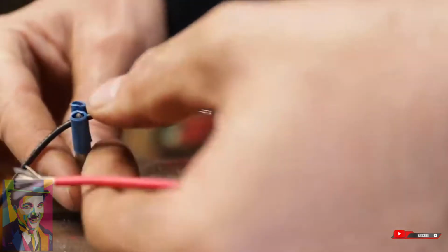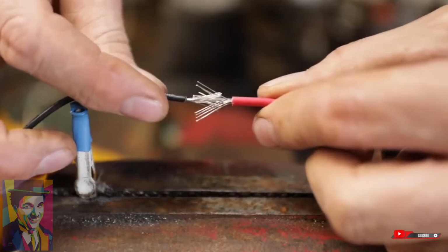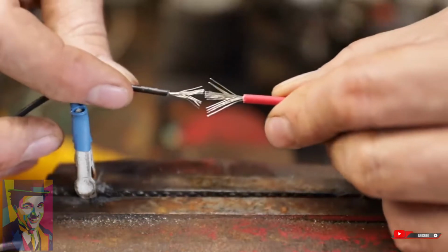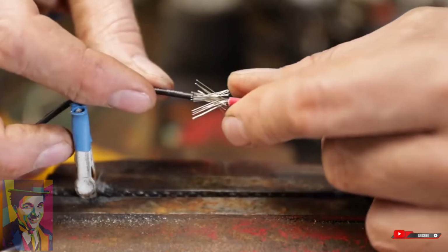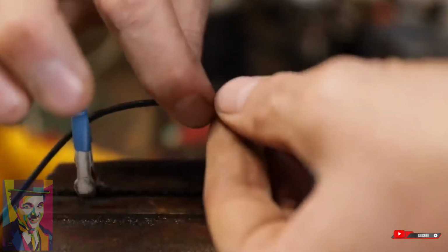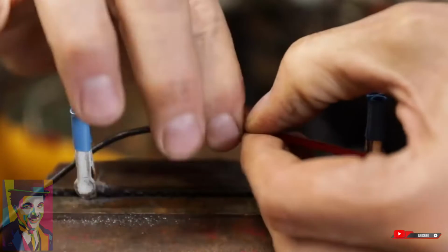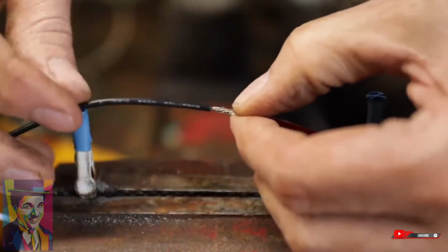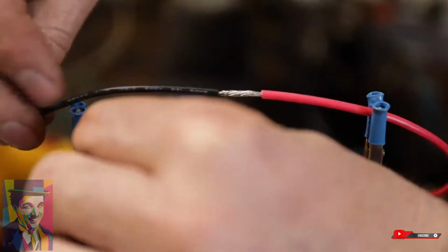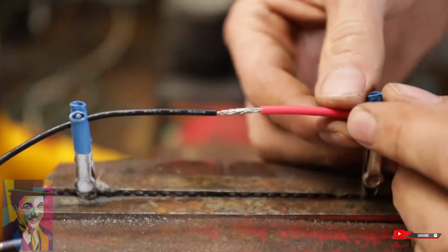So for joining the wire, there's a couple different ways of doing it, but what I have found to be the best, and this is what Granddad always did, is you fray the ends of the wire like this. You splay them out and join them so they intermingle, kind of mesh like fingers together. Pinch one side like this and start bringing everything together, and then twist this side, and then twist this side over here. That's going to give you the cleanest, smallest joint, because we're going to shrink it. If this is going to be something that's exposed and we're going to put our shrink tubing on there, it's going to be a little more low profile and look a little better. Now we can clamp it into our jaws and get everything ready for the solder.